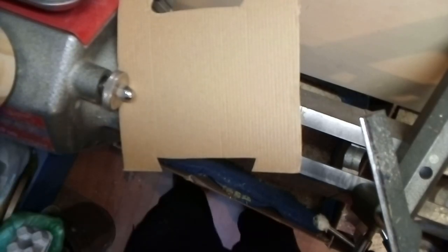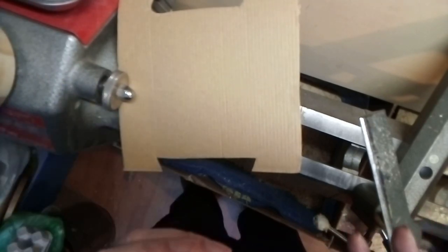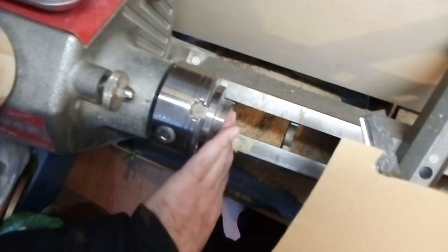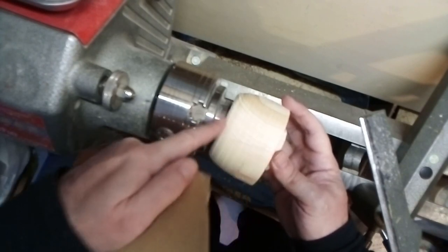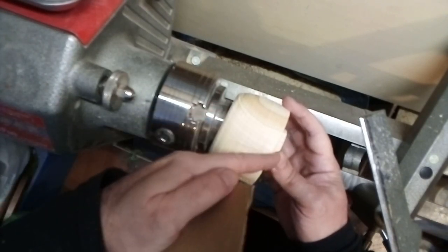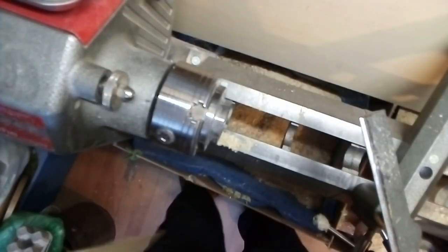And that is the root cause of all off-center problems. Especially when we turn and say, 'it can't be — I did it right on one side but now it's wrong.' At some point you lost the parallelism between the part that was held and the part you were turning. If you put it like this and suddenly fix one side, then there is no longer parallelism between this circle and the outer one. Here it looks fixed and it seems fine, but when you mount it, this side will move and you'll have to stop.